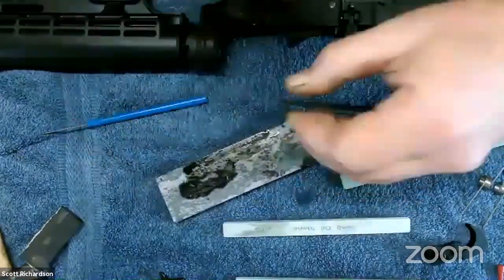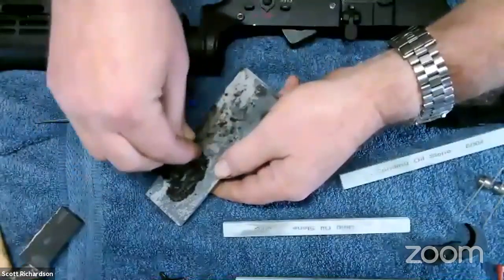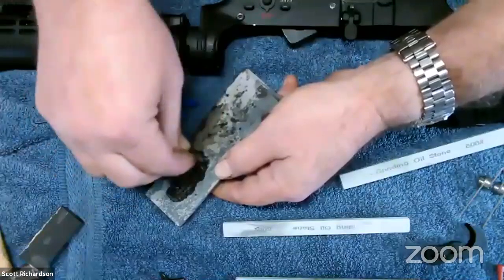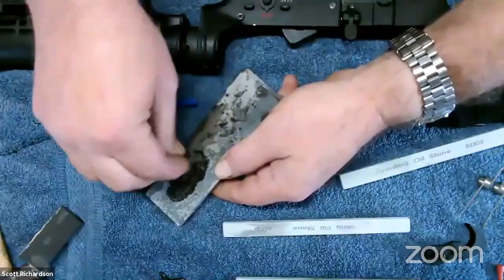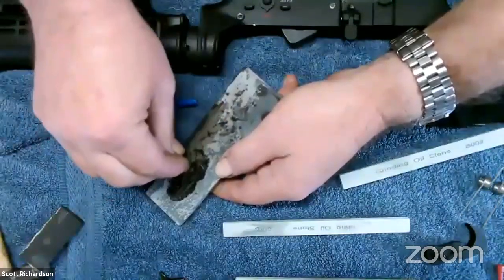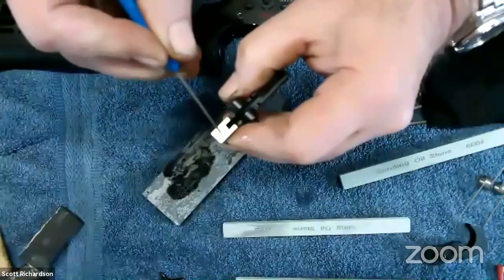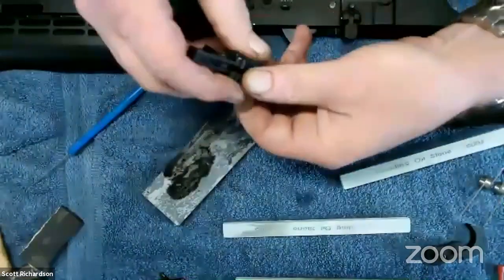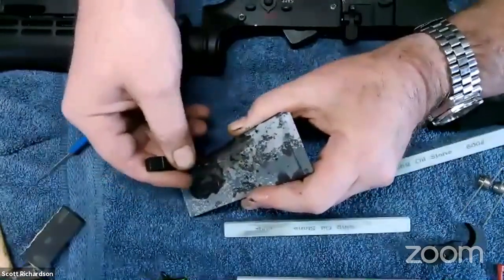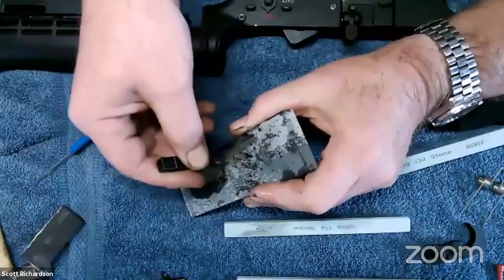We already have a volunteer for the trigger recipient. There are at least three volunteers, so Danielle — who supervises this gang of miscreants — can choose. They want plausible deniability when the trigger doesn't work. If you screw up an AR trigger, it won't go full auto — you'll get what's called hammer follow, where the hammer strikes and then the disconnector won't catch it, so the gun just becomes a single-shot rifle at that point.